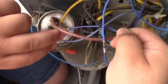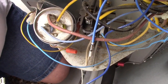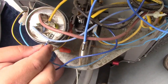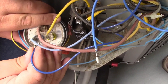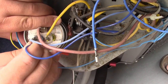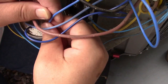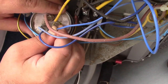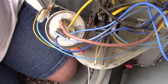Now we're just going to feed the wire through where it's nice. On this one, blue and yellow are COM and HERM. Yours may be different — check it first, read the labels. You may see it's marked HERM over here, FAN over there, and COM over there. We're going to take this now — it's just a simple push-on terminal. This also makes it real nice with the capacitor dismounted so we can just get that on. You're just going to wiggle it on all the way, just like that. There's one wire. The other wire we'll take and put it right through the same area to make it nice, and put that on the other one. Just wiggle that. It doesn't matter which way these blue wires go on. That's it. That's in.